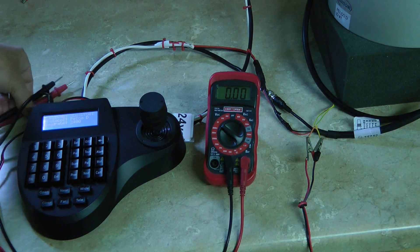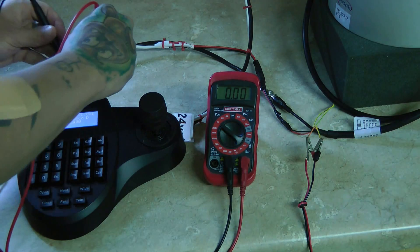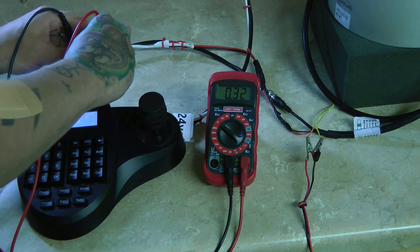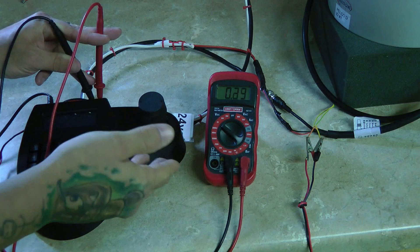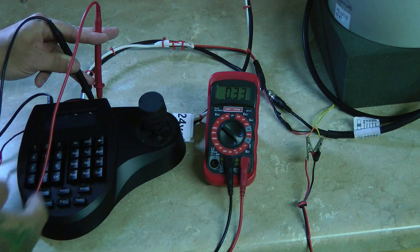If not, we need to get our meter out and test the controller — same thing with the DVR — just to make sure that we see, on our DC scale. I've set it to the 20 volt DC side, and what we're going to do is meter out that RS-485 directly from the back side of the controller. Just stick our leads across here. What you should be looking for is anywhere from 0.5 volts to 0.33 volts, what we see on the meter there.